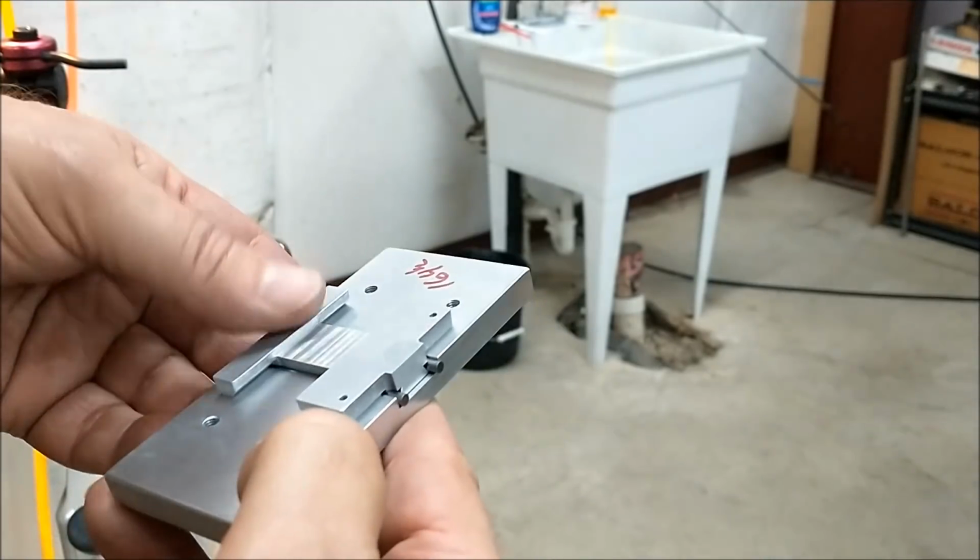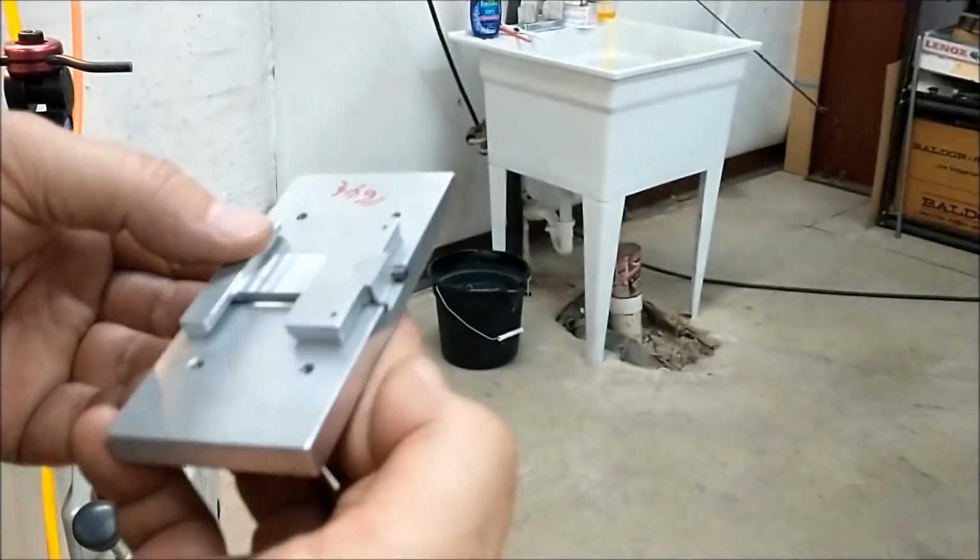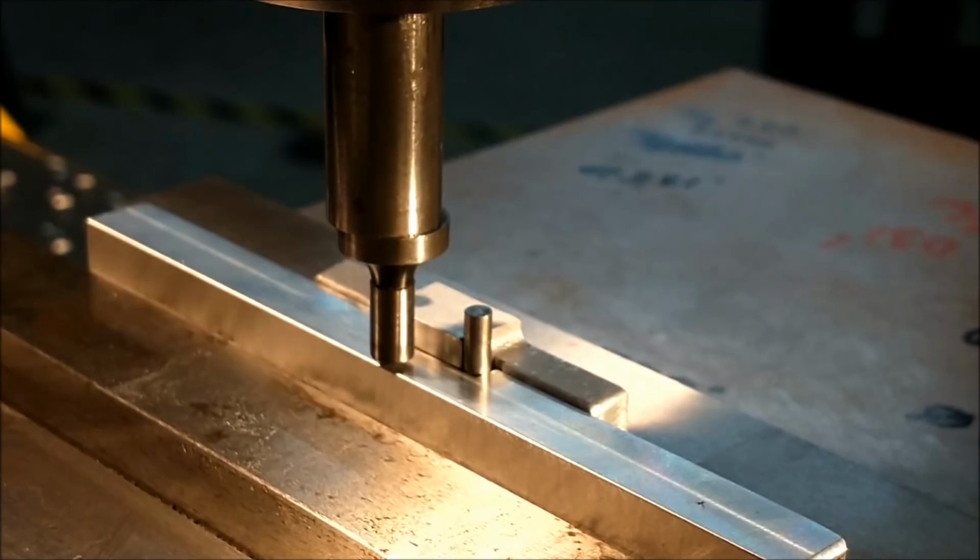Let's set it up and finish this part. Looking forward to seeing it. We are comfortably nested in the back side of the faceplate fixture. I'm going to bank off of the top of the 125 dovetail feature, move down the 094 on the print because there's nothing modified here. This is done by the numbers. Then I'm going to sweep these two 126 pins I used to create that dovetail to find the X center. Let's do it.